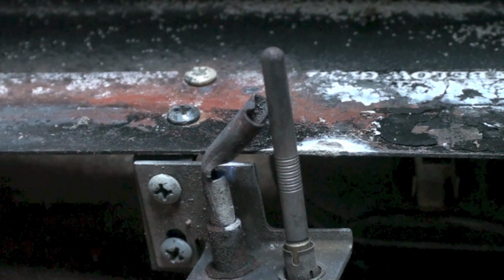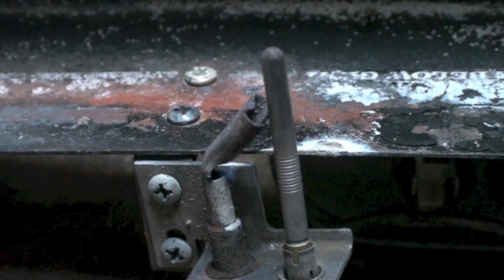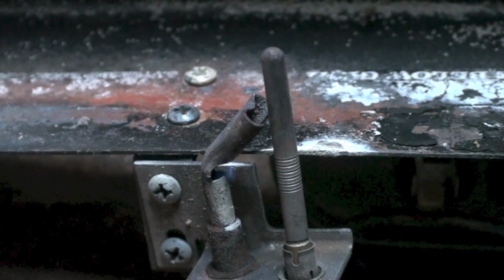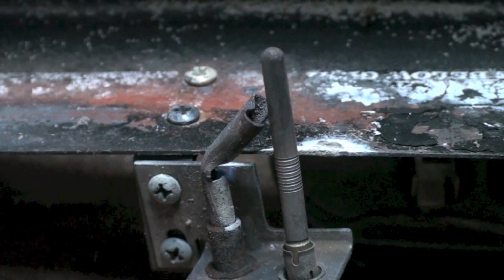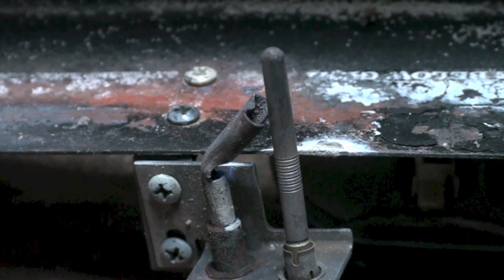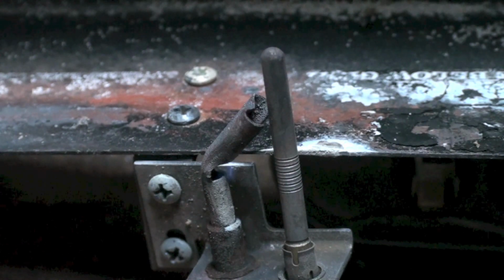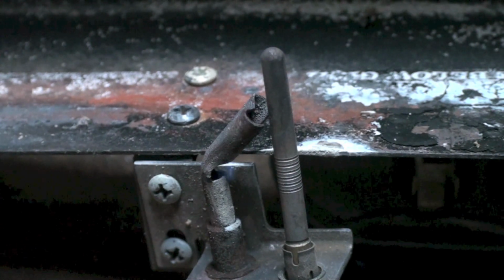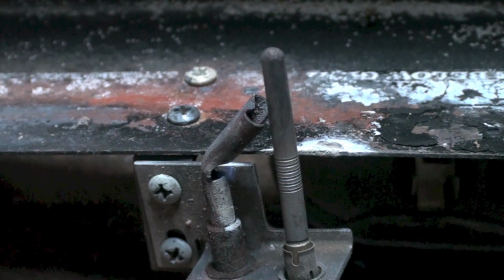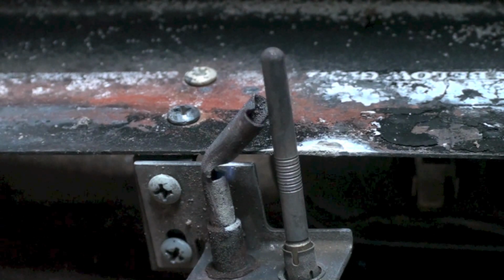For most of the gas applications we use these for, they're just safety devices. They're supposed to shut down if there is no flame. If this flame goes out, the power drops off of there and it lets go of a magnet that it's been holding in. So it doesn't really produce any great amount of power. I mean, there's a million kinds of thermocouples out there. A lot of them are used for sensing temperature and everything like that. But that's not what we're concerned with. We're concerned with this safety device. Okay, that's a thermocouple. It has one junction.